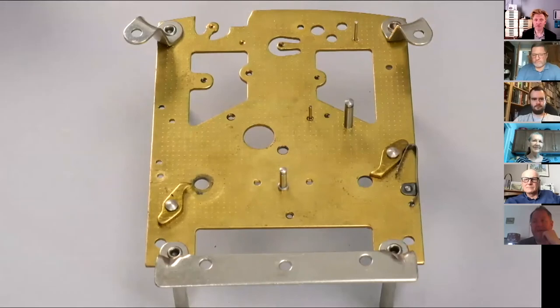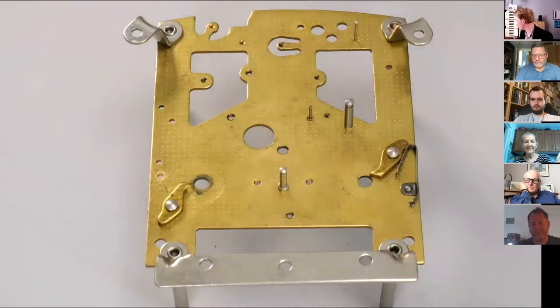But once you've done that, and I think people would agree here, I don't know where Jane is, if she's around, the next step is to get a very similar mid-20th century clock, again, because they're reasonably plentiful and they've got interchangeable parts. So if something goes terribly wrong, you can always borrow other parts from other clocks. And this time to get a clock that's got two sets of gears. So it's got a going train, so it shows the time, and it's got a striking train as well. So it'll strike typically the hours and the half hours as well, as this one does here.